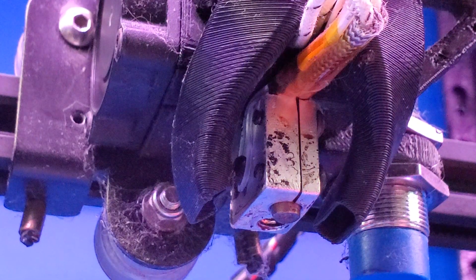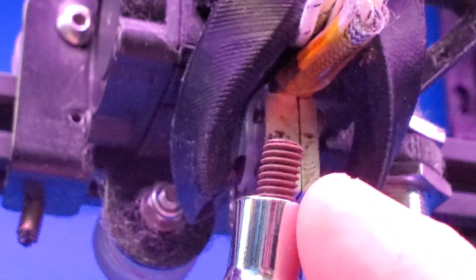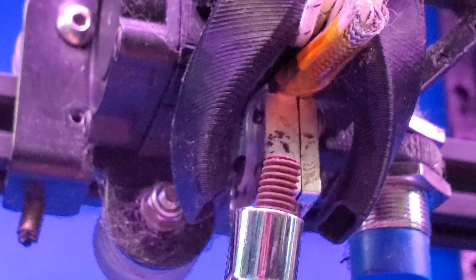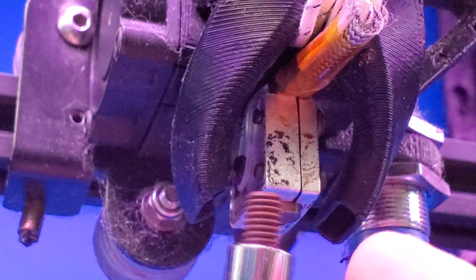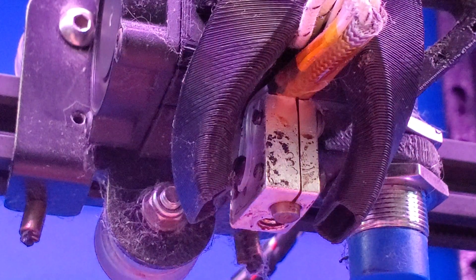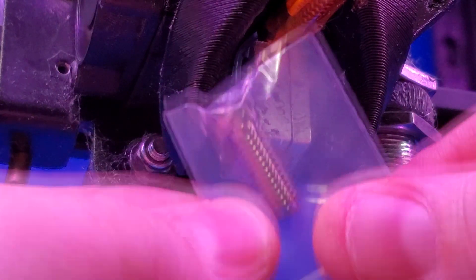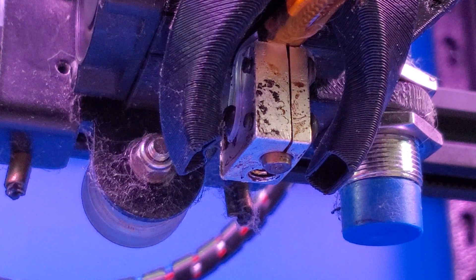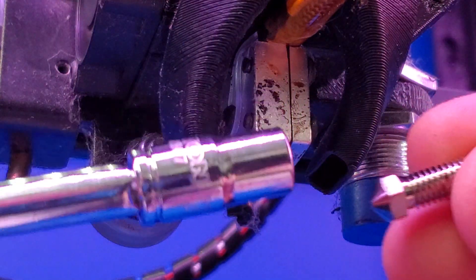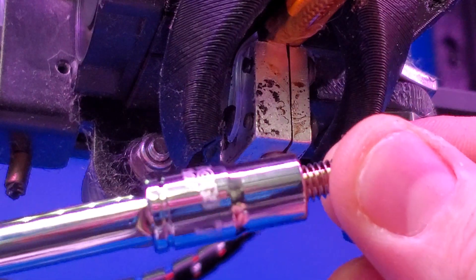I dropped about 4 degrees Celsius during removal, and you can see I have the nozzle out. One thing to look for on your nozzles is there should not be filament on these threads. You can see this is a little discolored, which is normal, but there's no filament on the threads, which is what we want. If you have filament on these threads, that means last time the nozzle was installed the heat break wasn't seated up against the rear of the nozzle. I'm now putting in the 0.6 EasyFlow nozzle for faster printing. Your replacement nozzle may be a different size, so double-check that — in this case, ours also uses a 7mm driver.